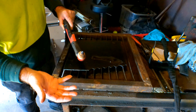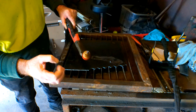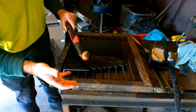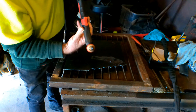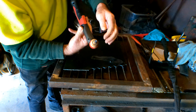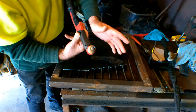So that's the importance guys, especially you new guys. You've got to get your air pressure right, you've got to have a decent amount of air pressure guys. Mind you, this is pretty extreme — this is with no air pressure at all — but I'm just trying to prove the point. See how that's actually destroyed that tip guys? Absolutely destroyed it. It's got a piece of crap sitting on top of it there, it's still smoking. It's that hot, I can't even hold it.